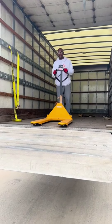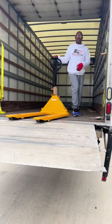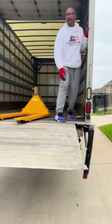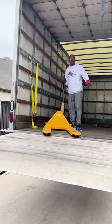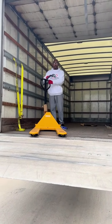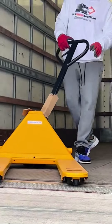So just imagine that you have a pallet here. You want to kind of turn here. Always go to the side where the lever is. Remember in the first video, I showed you that the lever is on this side. So you don't want to come in this way because you won't be able to use the lever to let the pallet jack down. So you always want to make sure that your back is to the side where the lever is.